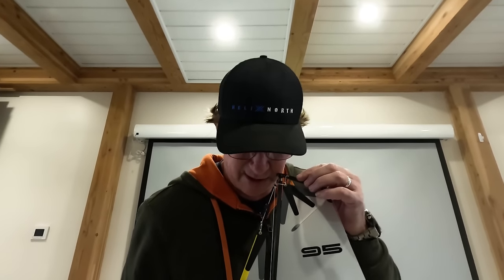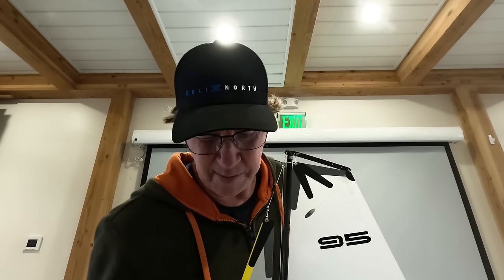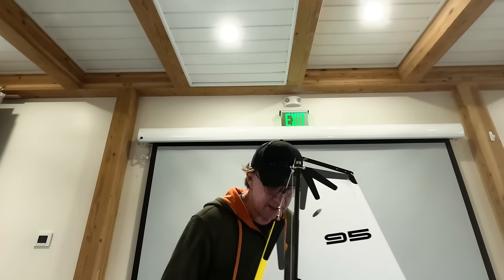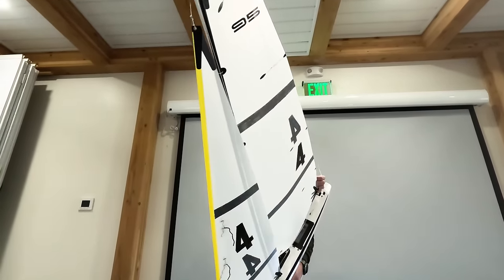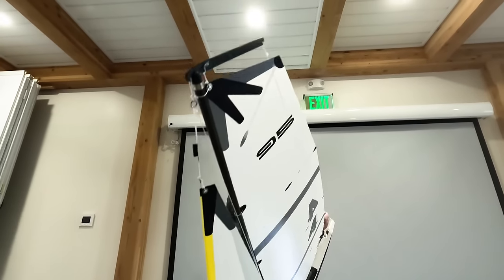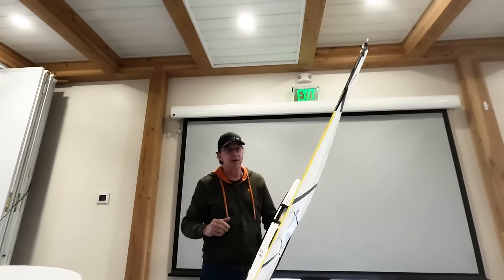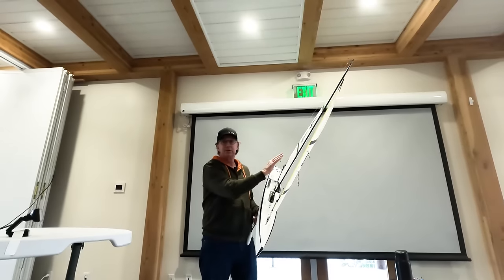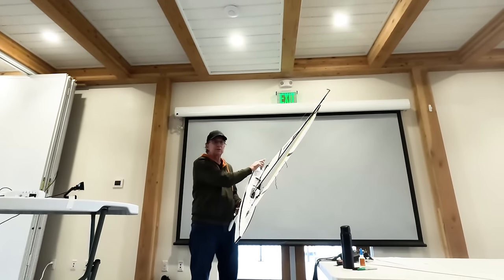Well, fortunately, this is not a big boat, and you can actually look at it in your garage or in your basement or here at Sail Newport and figure out, wow, it's bending like crazy down low. It's just something to calibrate in your own brain as to where you're going to make these marks. So I put a single black mark on my backstay where I think is absolute max mast bend, just starting to invert the mainsail. Just one single mark now.